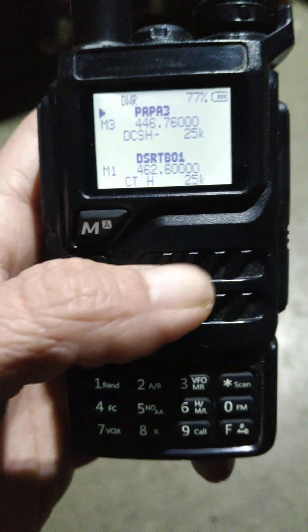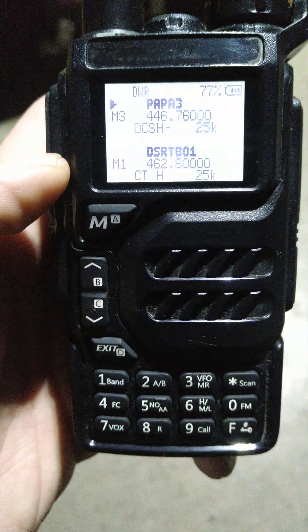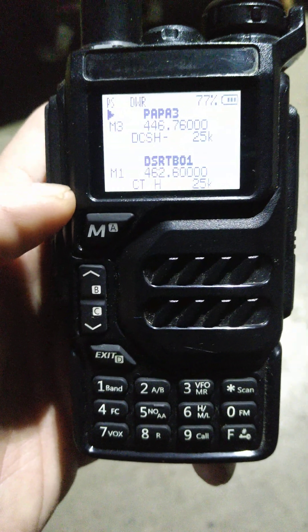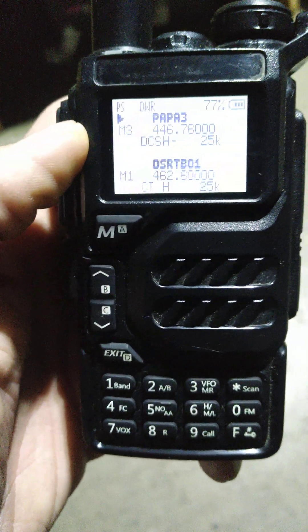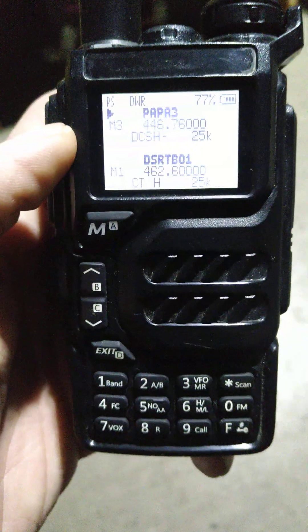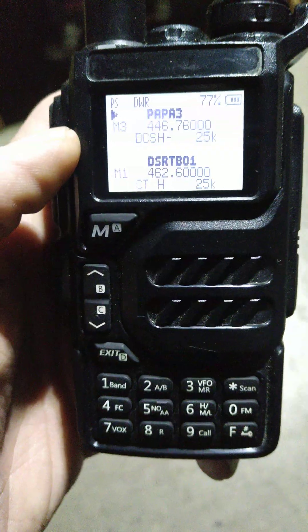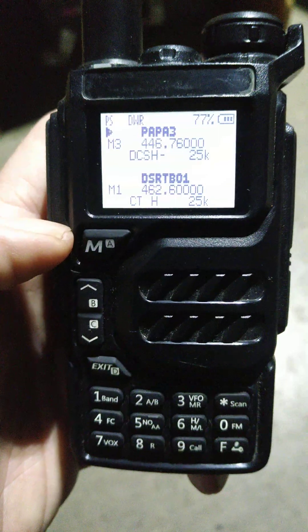This radio can run many different custom firmwares. This one I am running is Nunu version 20.5 by a gentleman named Camille — excellent firmware. It opens up the frequency spectrum from 18 MHz all the way up to 1300 MHz. You also have modulation for FM, but also AM and what's called dual sideband, which basically merges upper and lower sideband together on the receiving portion.